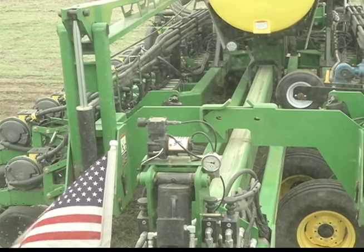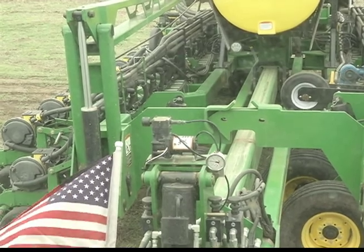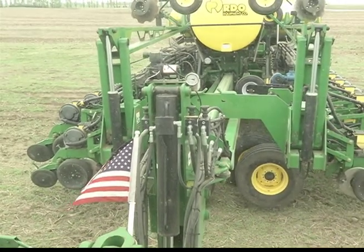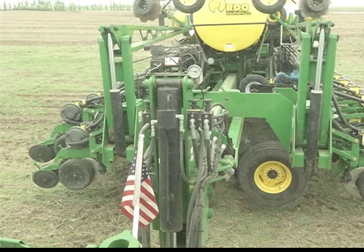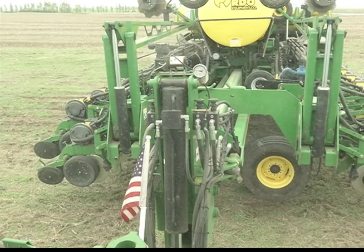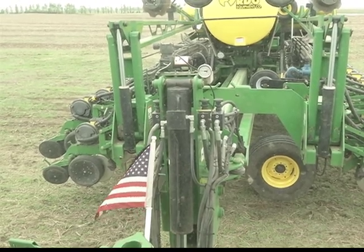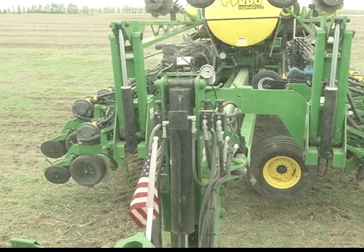Now once they're fully together, both wings are nestled in each other on the hangers. Now we will take the tongue lift and raise it all the way up to the fully raised position. Once it's in the fully raised position, you'll go to trans lift and raise the trans lift to the fully raised position. At this point, you'd go out and install your cylinder locks on the main frame cylinders and your U safety around the tongue to hold the wings from separating in transport.